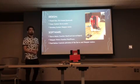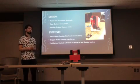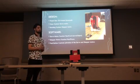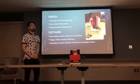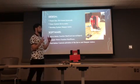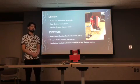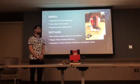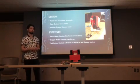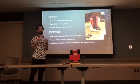Okay, so the second part would be the gate, which we designed using Lego pieces and a tread that we wrapped around it, connecting it to the gate. And the way it works is the servo motor on the side spins the gears, dropping the gates, spinning the tread. We have two rods stabilizing it so that both gears are on the same level and are both spinning at the same time. We connected the servo motor using rods and adapting the Lego pieces to fit the servo. Then we counterbalance the weight using nuts on the other side so that it'd be even and stable.